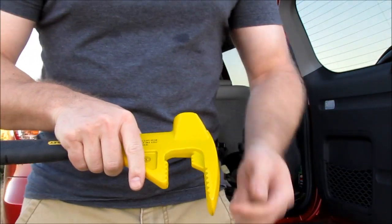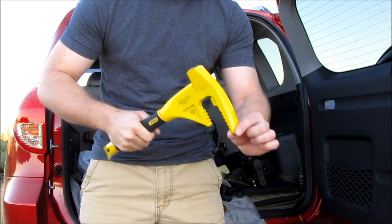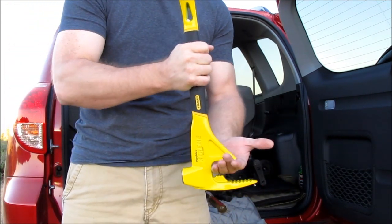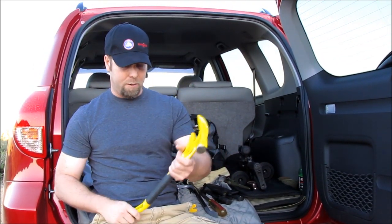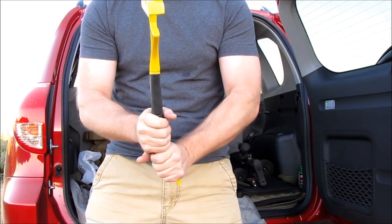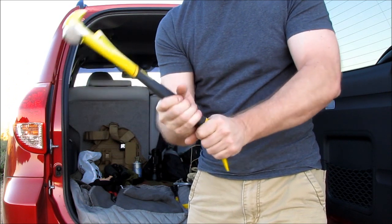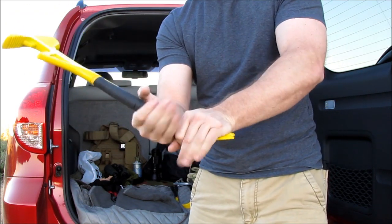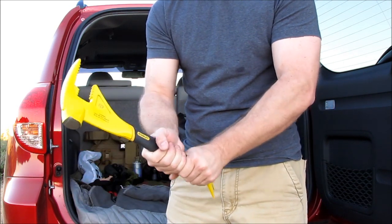This end can even be modified or sharpened a bit to make a wood splitter. If you come down on top of a 2x4 with the splitting surface, it acts as a wedge and will splinter the 2x4. You can also hook it under a 2x4 or 2x6 and apply leveraging force. As a swinging tool, it works better for me with the splitting end out. It's a two-handed tool — if I hold it this way my hand lines up naturally to swing. Turning it the other way with the hammer in puts my bottom wrist at an uncomfortable angle.